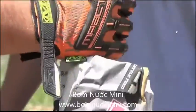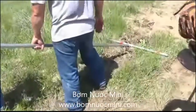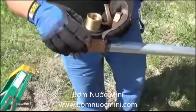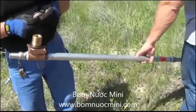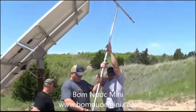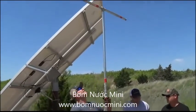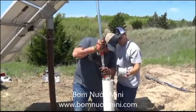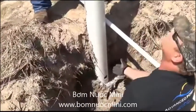Now we're going to remove our pipe with the sack — it should have caught any shavings that fell inside. We've got our hole installed. When you install a pitless adapter you'll need some type of pipe to run out the top of your casing; you'll attach your pitless adapter to it. We've already plumbed that all in. Now we're removing the outer portion of the adapter and we'll use this pipe to slide down in the well casing and poke the brass threads out. We put a large T at the top, because these pumps are fairly heavy — just over 40 pounds — so we need that T to hold on to the pump pipe once the pitless is installed.